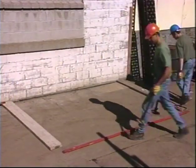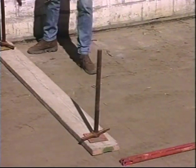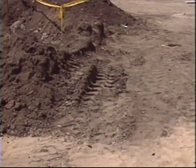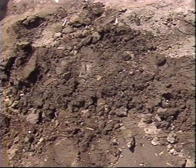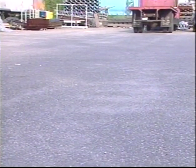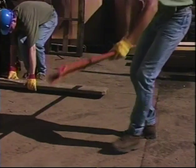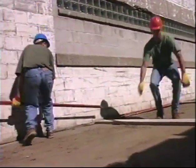You should always use a base plate on a scaffold leg. It gives you a flat bearing surface and will keep the tube from getting deformed. On compressible surfaces like soil or asphalt, a base plate alone may not be sufficient. Soil that's dry and solid one day can be mud the next, and heat will soften asphalt. That means using a timber sill to help distribute the weight. Level the ground so the sill has uniform contact and the weight can be distributed over the whole area.